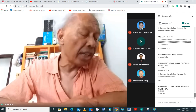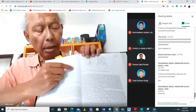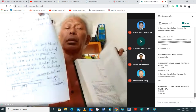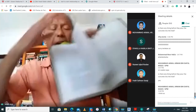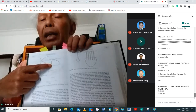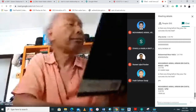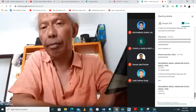So as I'm increasing, I get this hyperbolic shape. Then my earlier picture shows you the concrete blocks. I am loading. Now I can remove the concrete block and therefore I am unloading. See here, I'm unloading here, at the bottom. And soil is not elastic. It doesn't come back to its original point. So that is the settlement against load in the maintained load test.